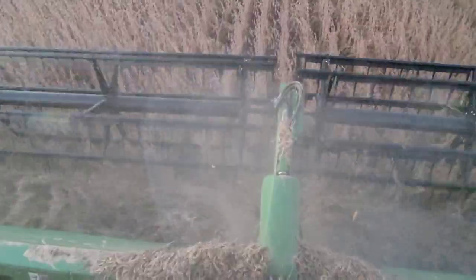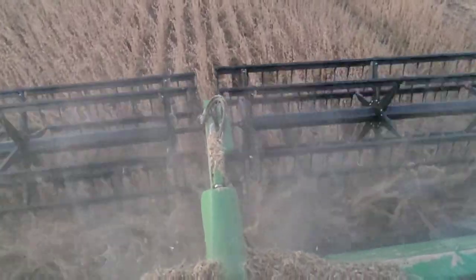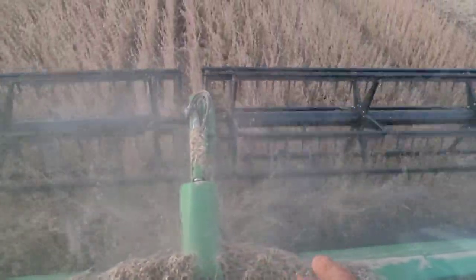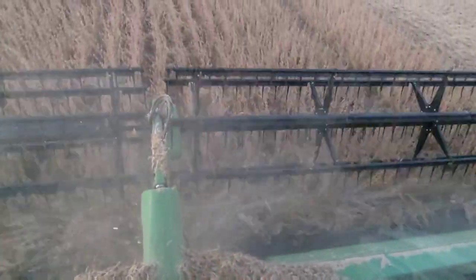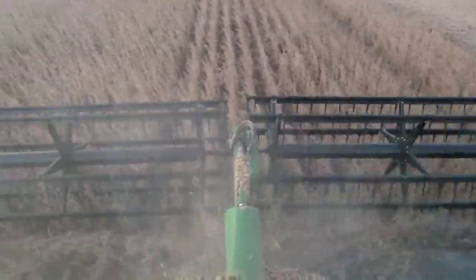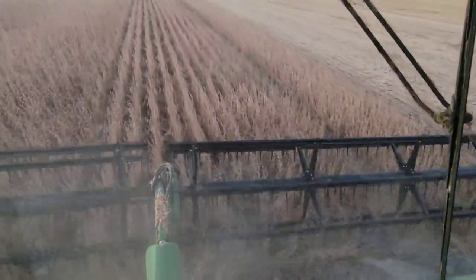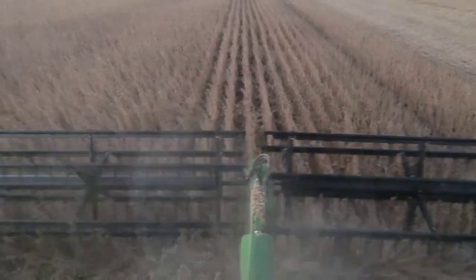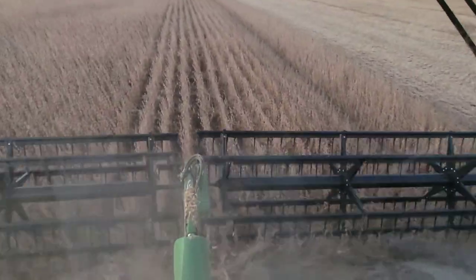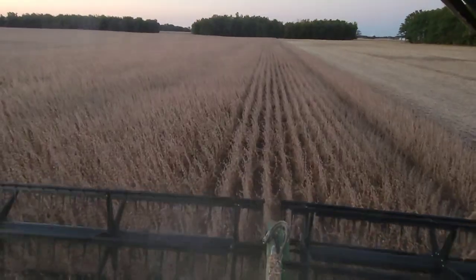The rest of it looks okay. We fixed the one broken guard. That stuff in the middle wasn't actually a guard — it was a couple of knife sections that are broken. I don't have the right ones with me, but right there in the middle they actually overlap each other so they're still cutting. I need to fix it, but I think the two guards were too close together and it was causing it to heat up and break. I just fixed some of that when we were finishing up beans the other day, so clearly something was not right. I do have the parts back at the shop. I'm going to keep running it until I can get them.